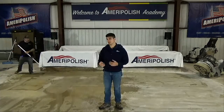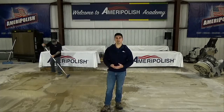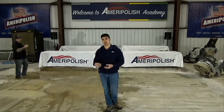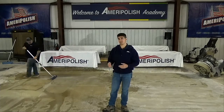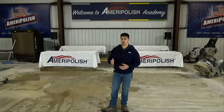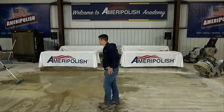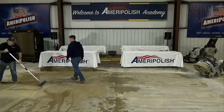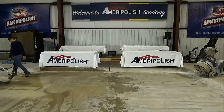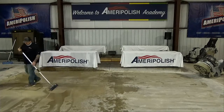Actually, what we've always said is just run like normal. So at whatever you're used to doing, you can use our grit equivalent chart to figure out where each grit lies. Your 00 is a 40, your 0 is a 100. So use that as a guide and just stick to the typical RPMs that you would run. When it comes to RPMs, I haven't found where it changes a whole lot until you get into the power trowel system. When you get into the power trowel system, then the higher the RPM, the better.